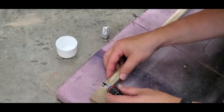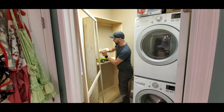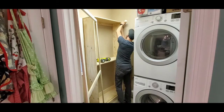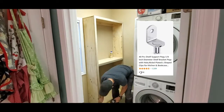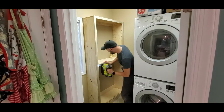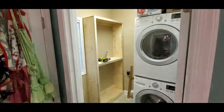Trying to fix the screwed-up part with Star Bond, which did not work this time — everybody has magical Star Bond stories, but that one didn't work. So here I'm putting a bead of glue along the front edge of the end grain of the plywood so I can cover it up with the poplar face frame and make everything look nice. I already have my shelf pins in the holes. I'm using an 18-gauge nailer for the face frame — that's a smaller nail, which makes it easier to clean up those holes later. You don't want to use the 16-gauge if you don't have to; if you've got an 18-gauge, use that.